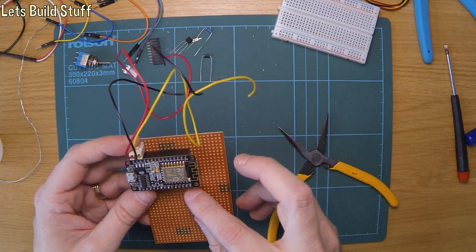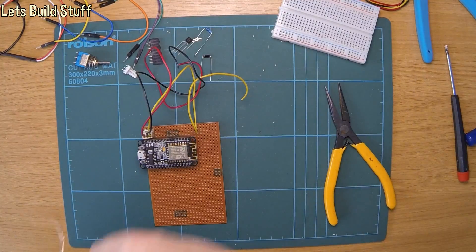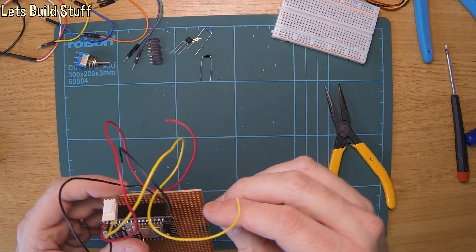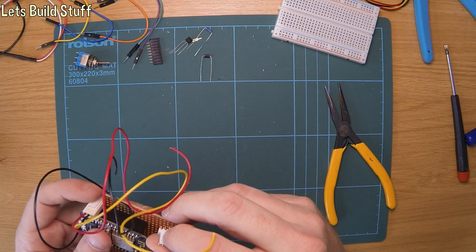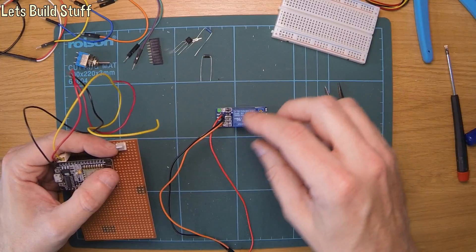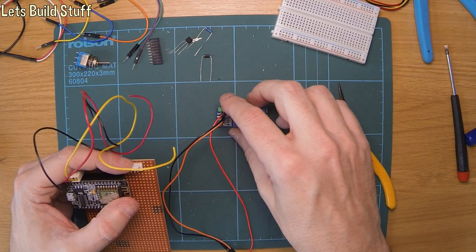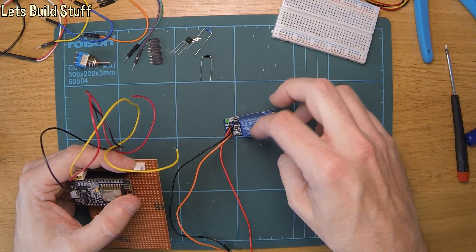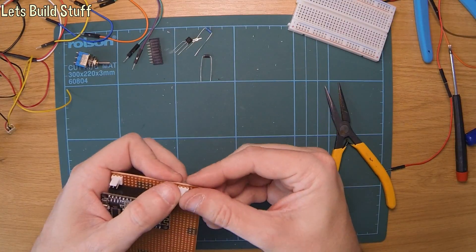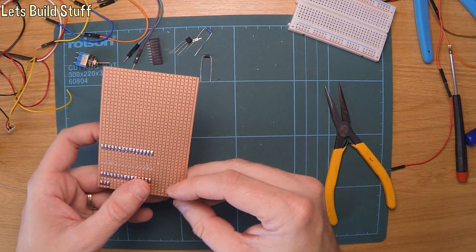I was using D2 in the code so I'll carry on using that - that's actually GPIO4 by the looks of things on this Arduino. I'll start putting the rest of the circuitry on because I'm going to have to put another fan header up here to control the relay, which is three pins. Two of them obviously are going to be ground and live, so I'll just bring them up and put them on the two pins. The third pin will be the switched ground which turns the relay on and off. I'll get that one soldered in - might as well put it on the edge because it keeps everything at this edge. Then I'll move over to putting the transistor, the diode, and the resistor on.